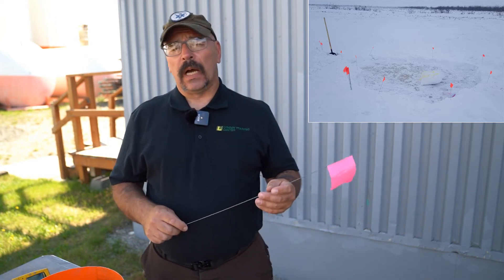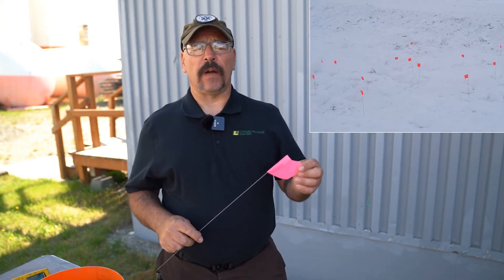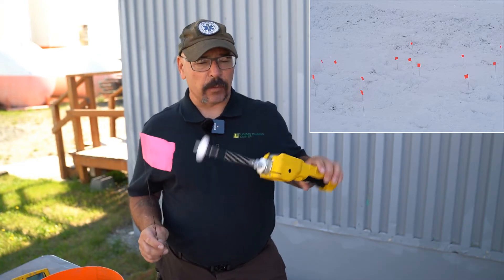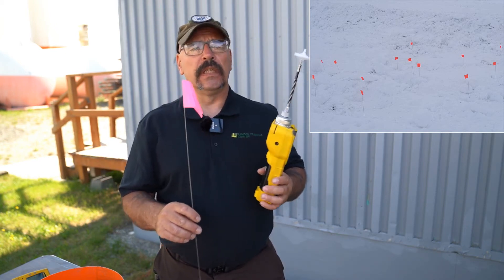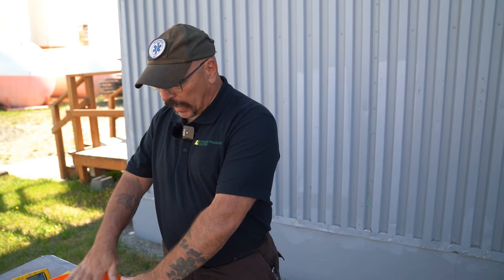If I don't have a visual indicator, then anywhere that I do air monitoring a flag would go. If I'm just going around disturbing some soil with the PID and I get a reading, I'd stick a flag there without even writing the reading on it yet — the only thing I'm trying to do is locate where the spill is. Liquids travel through sandy, gravelly soil very rapidly, so you can have an initial spill site that plumes out underneath the top layer.